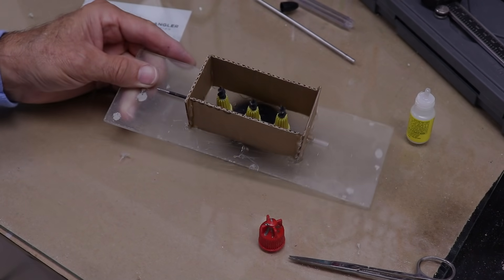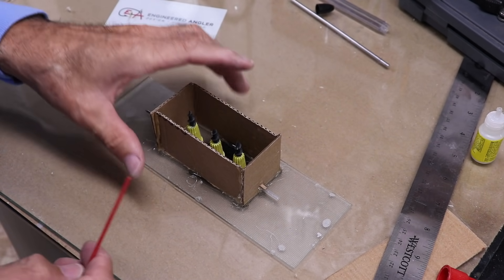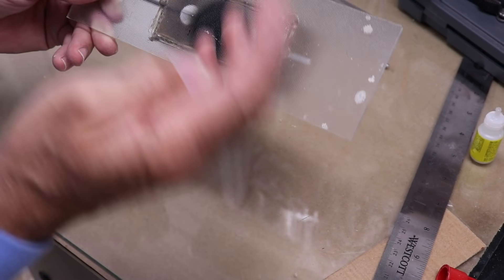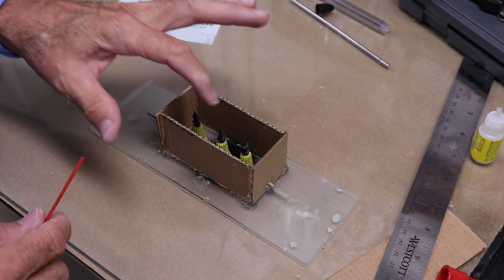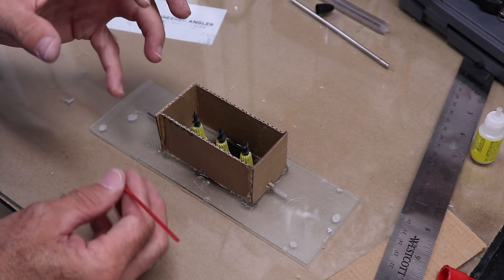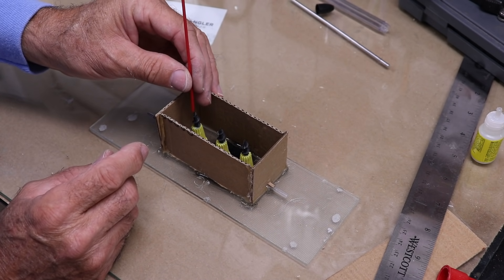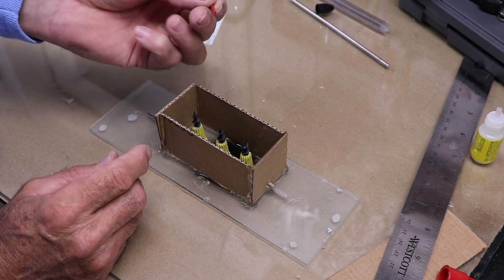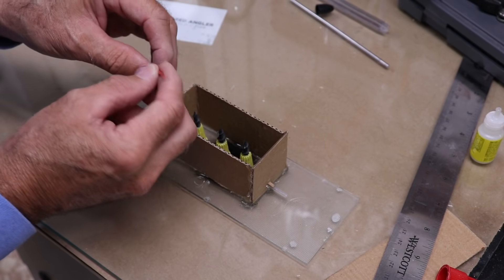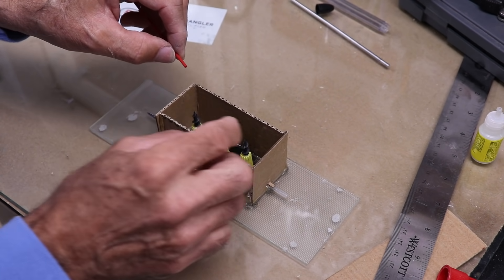I'm going to let this cool off a little bit. One other detail is venting: since I'll actually be pouring from this side once it's all pulled apart, I need to vent these little cavities so the resin will pour in there and won't develop a giant bubble. To do that I'm going to vent through the very bottom using this little tiny red hose from a lubricant can — I'll cut three pieces about a half inch long and just wedge them on those peaks.